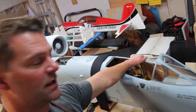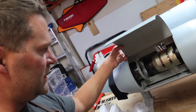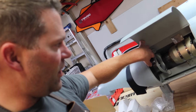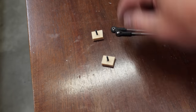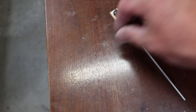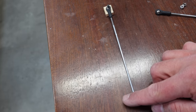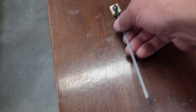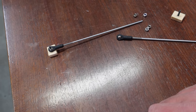Next things to work on are fitting the cockpit and making two little holder arms so the engine pod hatches can stay open when firing up or working on the engines. For each hatch we'll glue a ball-joint arm onto the door itself - when the face is down it locks into the former. We'll put a little L-bend on it, and when you want to get it out of the way just twist it up. There'll be a small keeper on the side for a nice simple system.